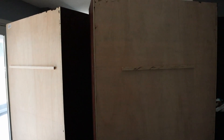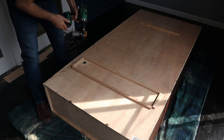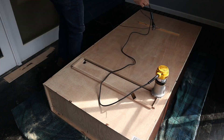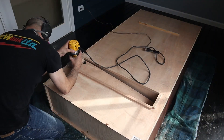With the back pieces on, I used a hole saw to punch through the backing, and then switched to a router with a pattern bit to cut through the rest of the shape. The pattern bit has a top-mounted bearing that traces along the wooden pieces and cuts out the exact same shape.